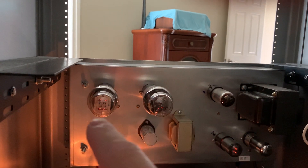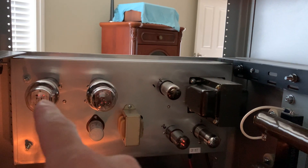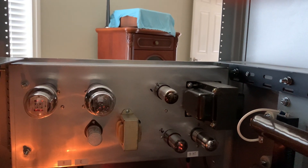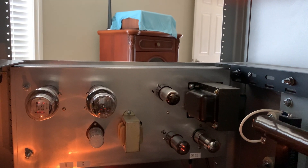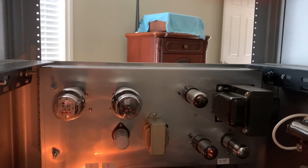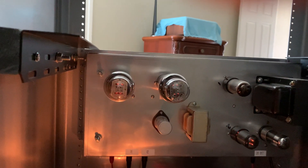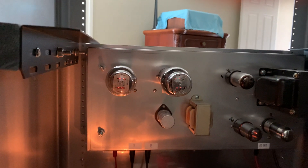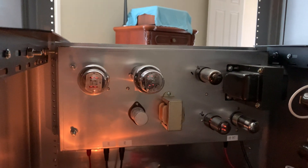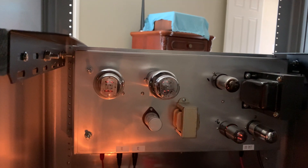The way it is, I have a 375-volt supply on here, and that's really too hot for 6A3s, 2A3s, or 6B4Gs — they're all the same tube. They're not really ever supposed to be run above 300 volts max. They used to run them hot to compensate when driving two 810s, because two tubes barely provide enough power — that's what they did in the Collins KW1 and the Desk Kilowatt. But it's not good; those tubes don't last.